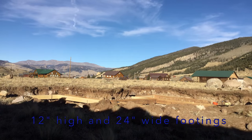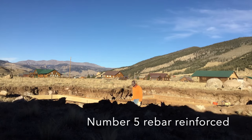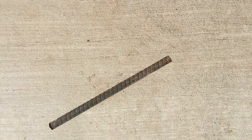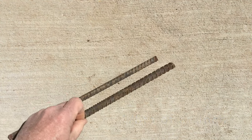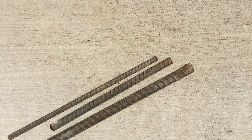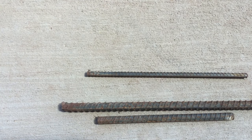I'm using 2x12 which is a little excessive — they're 24 inches wide and they're going to be 12 inches tall. I'm going to repurpose these forms and use them on my floor joists later. Let's get into the terminology for rebar — that's your steel reinforcement in your concrete. In a footer, typically you're going to want half-inch rebar, that's number four. Number four is your most common in residential footings. The measurements for rebar are really simple: it's in eighths. So a number three rebar is three-eighths, number four is half-inch, and five-eighths is a number five. When ordering, number five is for the big stuff, four is most common, and three is just for tying things together.